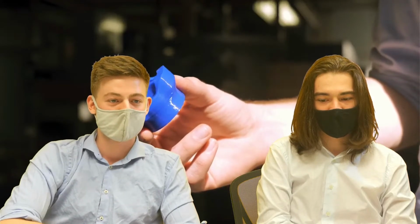Encoder runout sensor. Oh, that's the one where it spins around. It depends what message it sends to the printer, I think. That's what we'll have to test. That'll be fun. That's actually useful. Those encoder sensors are strictly better as long as they work reliably. It tells you if filament stops moving, even if it's still got filament in there.